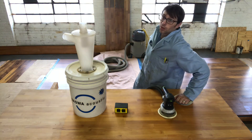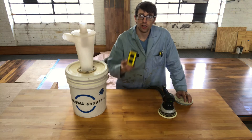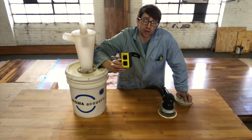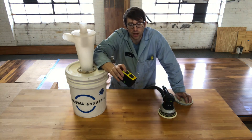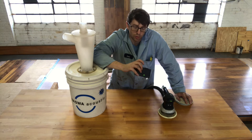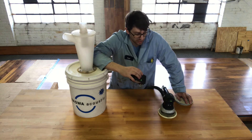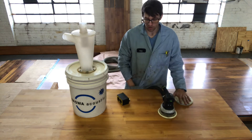We also have a vacuum behind me — that's what's doing all the collecting. Another nifty tool is the auto-switch socket. It's built for jobs like these: the top plug is the tool and the bottom plug is the vacuum. They just plug into a single socket. When it senses power, the vacuum turns on when you pull the trigger of your sander, and the vacuum continues to run for about five seconds after your trigger is released, therefore clearing the lines of any dust. You can basically make this whole process very dust free. We'll do the most work with that 40 grit, tear through everything, then work our way back up to 120.